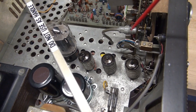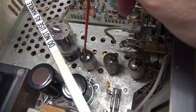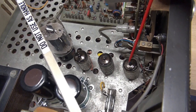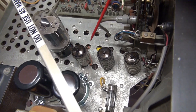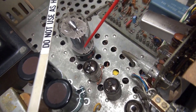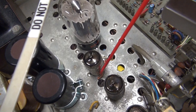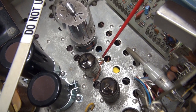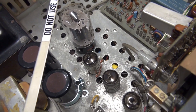And then if you look topside at your Tram, you'll see the three 6GH8 tubes. None of them had shields. I ended up installing shields on all three, and then this one that feeds the 6L6, I actually put a copper braid and soldered that to chassis, and then all the noise problems disappeared.